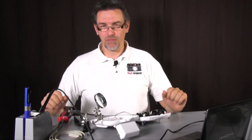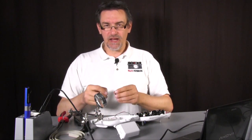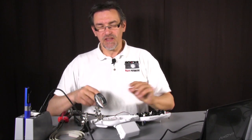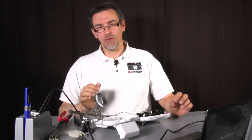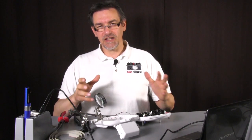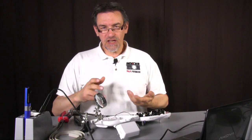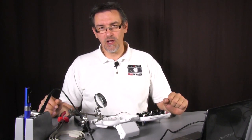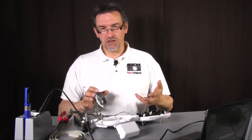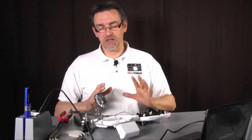So this was the first part, the easy way to put the tilt lever into your remote control of the Vision 2 and to upgrade the software. Now we can make a second step, and in the second step we can put a potentiometer in the remote control. The reason is it has a little bit longer way, so you can work a little bit more precise. And if you use a holder, sometimes when I use my holder, it's difficult to reach the lever under the remote control. With my holder, it's not possible to reach the lever without leaving the stick. So for me, that works not perfect.